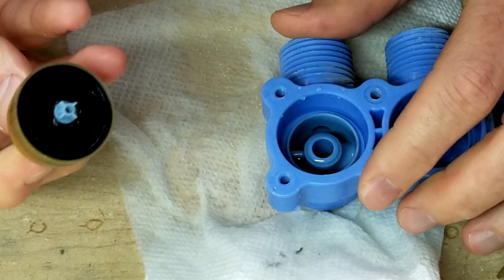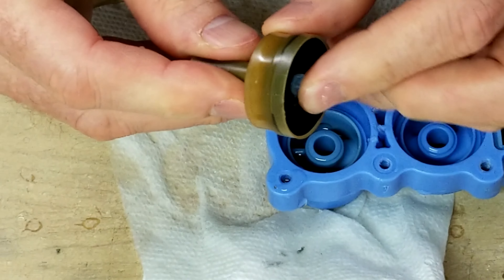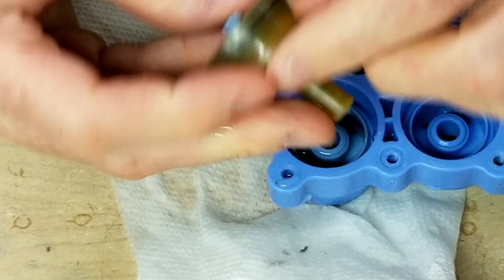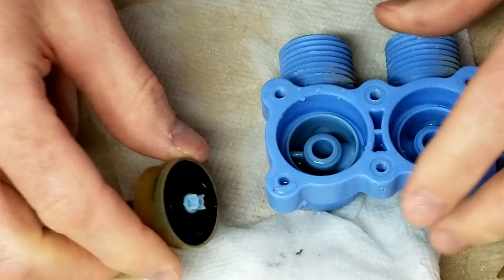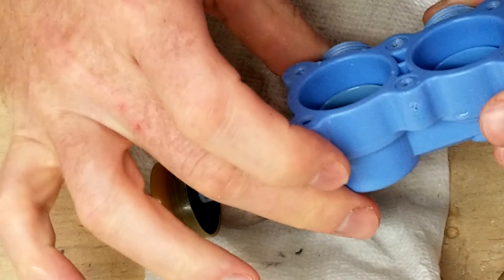I imagine we'll see the same over here. It's a little spring — basically a spring diaphragm that when the solenoid kicks, it lifts it up, causes it to break that seal right around there, and then water flows in straight down the little hole. It's really quite simple.